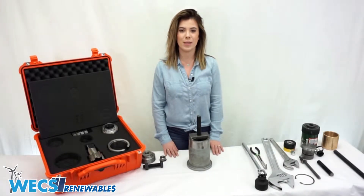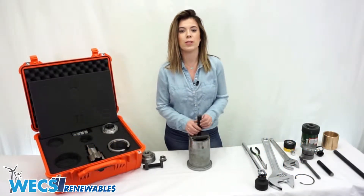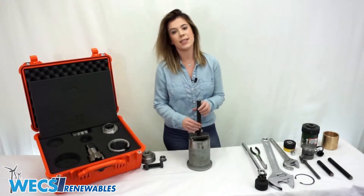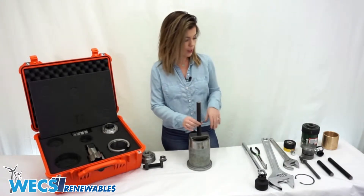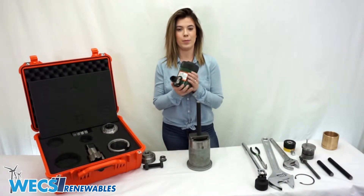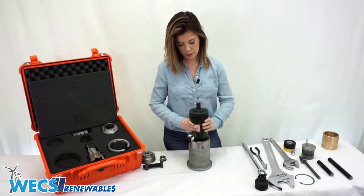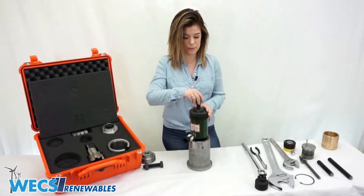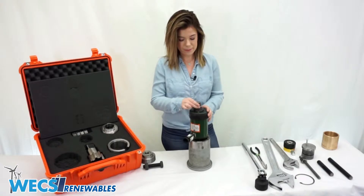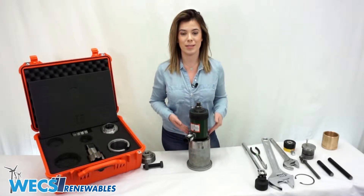I'm now going to show you how to extract your seized piston using a standard 8-inch hydraulic cylinder. For this method, you're going to want the 14-inch all-thread. Thread it down about an inch into the pulling plug. Then grab the 8-inch hydraulic cylinder — this does not come with your kit, but WEX can supply it for you. Place it on top, rest it on the pulling cap, grab a nut and washer, and run the nut down so it's snug against the hydraulic cylinder. At this point you would hook up your pump, and when you turn it on it's going to drag the pulling plug and the seized piston completely from the cylinder.